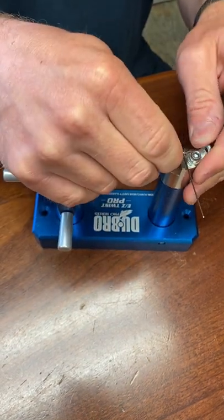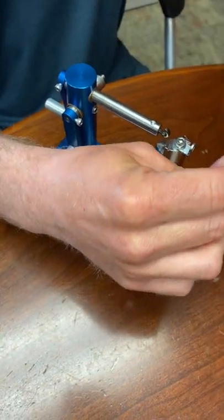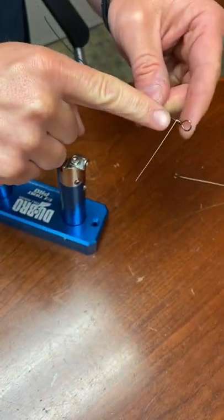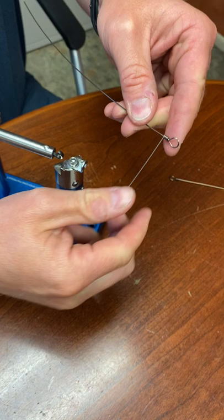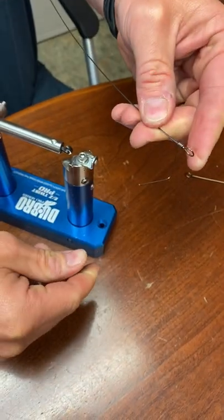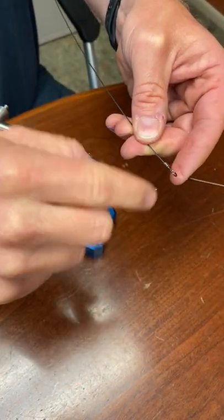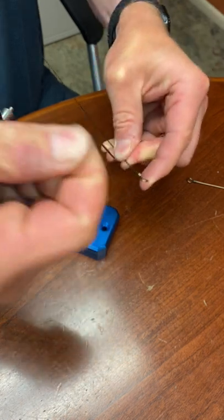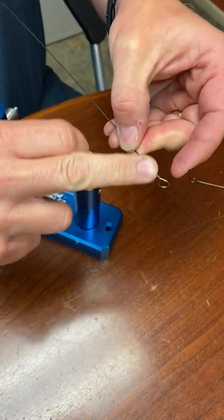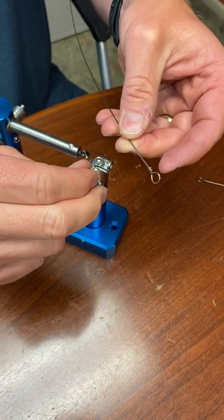Now I'm going to remove the holder — take it out. That's your barrel wrap. Now what we do next is take the wire coming over the wrap and down, and make a 90-degree bend right here. So now that's kind of a handle for us. I'm going to take this handle and wrap it straight up alongside the wire, and it just snaps. The reason you do that is it's nice and clean — if you use side cutters, you're going to have a burr there and it's going to catch on weeds.